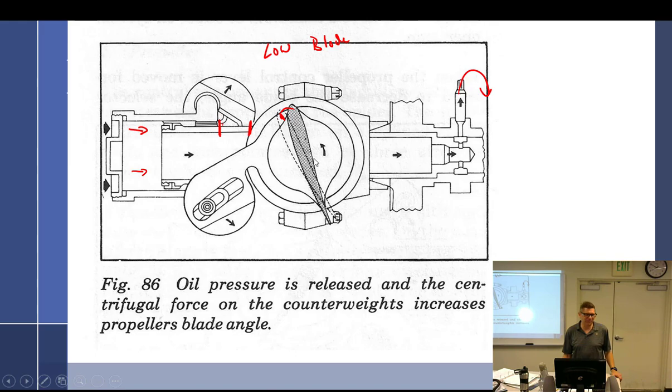Well, what happened is his mechanic didn't install this equipment up here right on the propeller. The seal wasn't here. So all the oil came through here, leaked right out of there, went right down the propeller blades, all the way down the propeller blades. These are big props, same size as the ground adjustable. And for that length of it, it just sprayed the aircraft with oil.